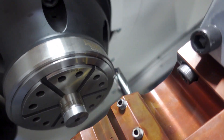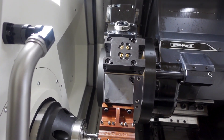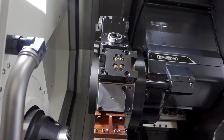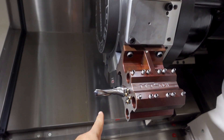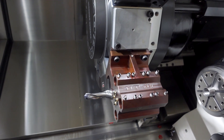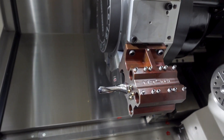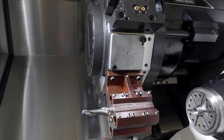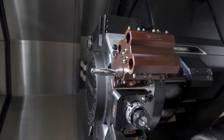We're setting up the drill — clearance is clearance, right Michael? I've got Michael here training me and Scott with Tungaloy here as well giving us a hand. Do not index the turret right now. So we've got some tools in here so far: this is a three-quarter inch drill I'm going to use for my easy tuners — it's actually going to go in a dedicated holder with coolant-through, but we don't have that bushing yet, so it's here for now to play with offsets. I'll have four different bars in there — boring bars and ID threading bars in this holder.